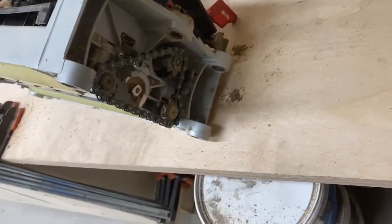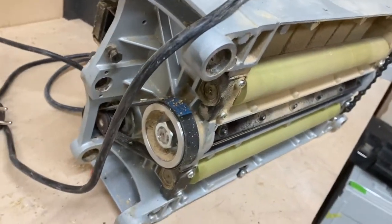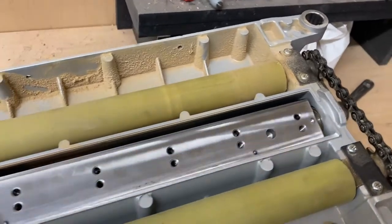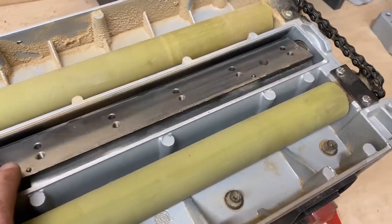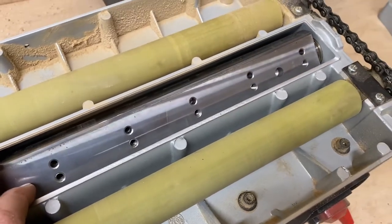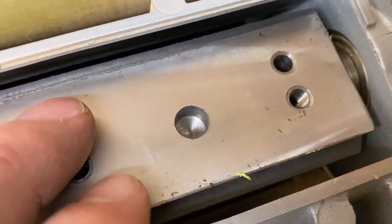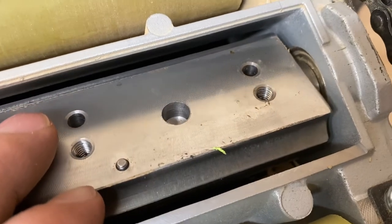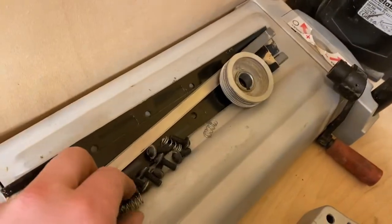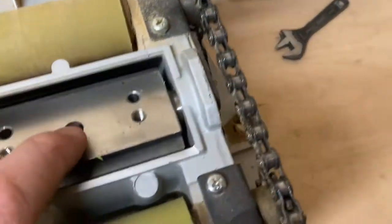So next step, I guess, is just to get started on the most interesting part, to remove the cutter head itself. Okay, so we removed the old knives on the cutter head. Sits with some Allen screws. You probably have replaced yours once or twice already, I guess, so it's really easy. There's a lot of debris between the block and the knife, so no wonder you get a lot of inaccuracies. And if you want to keep it, just make sure to know where your little springs go, and they sit here.